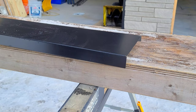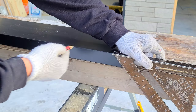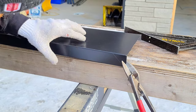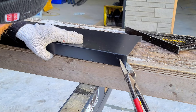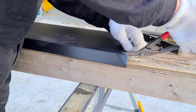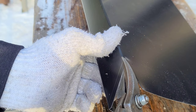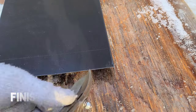Let's move on to marking and cutting. We're gonna drop in our 45-degree line — for clarification, we are making the top trim. There's our square line. We're now going to start notching, leaving a little bit off the line, and you'll see why later in the video — it just makes for a nicer job. We notch in and completely remove this piece here. There's the finished notch.